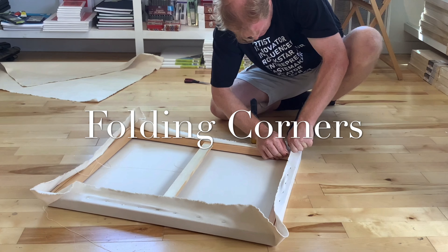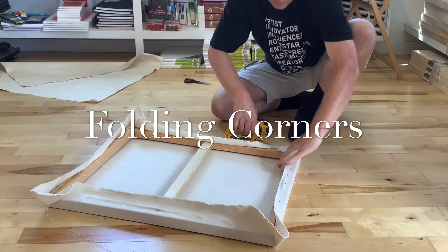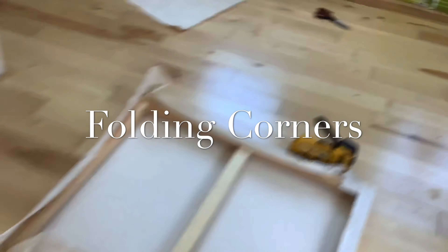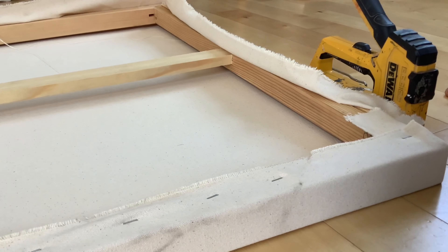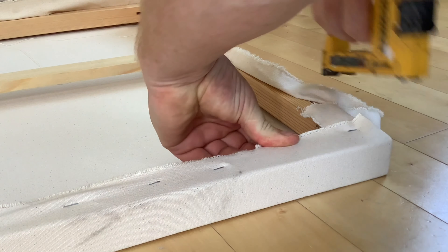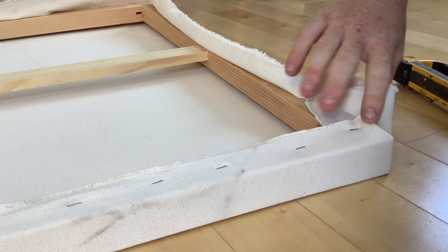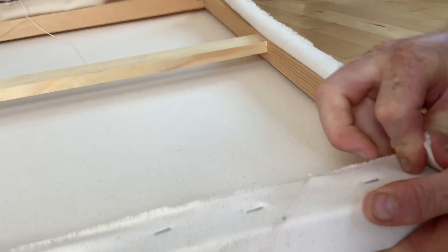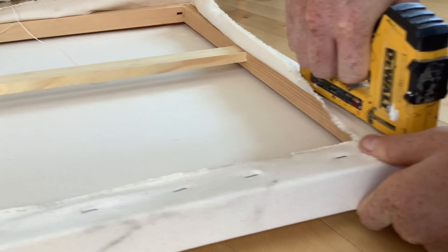Folding the corners. I go both left and right, tack one edge in place, and zoom in closely here because this tends to be the part where people really want the most help. Right on the edge I fold it to be in line with the corner and with the edge. I do that one first and pull it nice and tight because you don't want those wrinkles. Staple it in place.